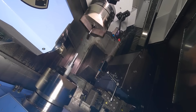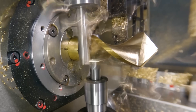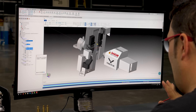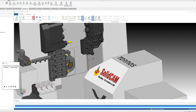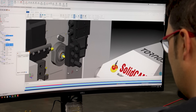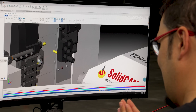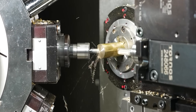Building out your holders is important because that brings me to the next thing that I really like, which is simulation. You know from me running the 9-axis that I've always said that you need a good simulation for a machine that complex, and the Tornoses are no exception. You want to see when you have all these tools running at once, or different tools on different sides of the machine, that you're not going to have any conflicts or anywhere that they're going to crash into each other. It loads super quick. I can see everything that's happening in the machine — they even have a little machine housing with our logo on it. When you start running it I've got my face pass, my drill happening, the peck drill cycle, and I can make sure that any tools next to each other are going to have enough clearance. If I need to stick out any tools — like I found on some of my milling operations where I actually have to extend them in order to not crash — it's really helpful. I think it's necessary whenever you're running machines this complex to have a really good simulation.